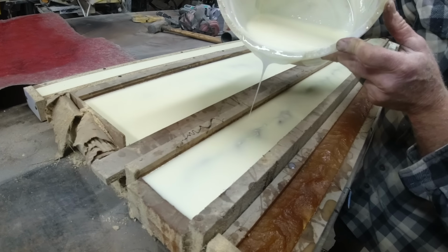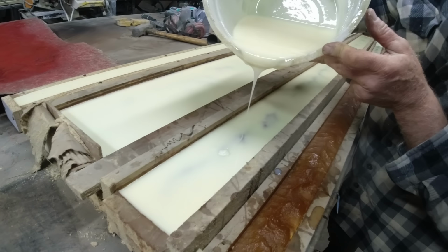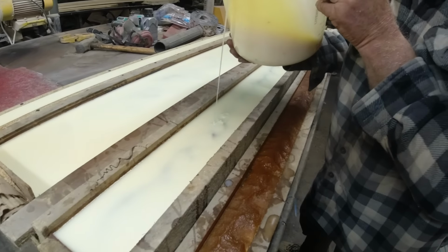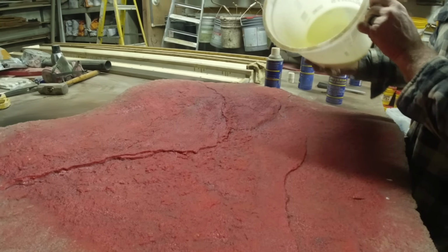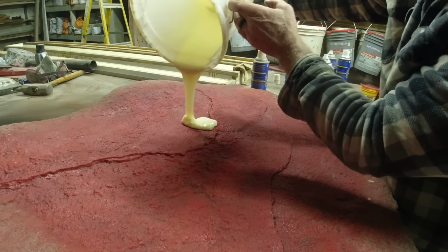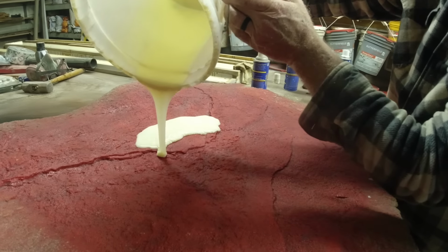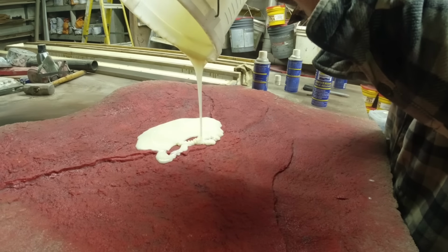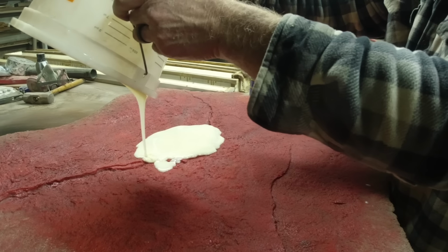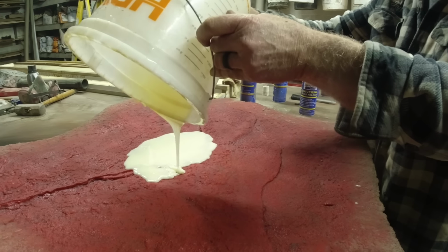You can always add it, but like I said earlier, when it's overflowing onto the floor, that's just money dripping away on the borders. So we'll make another border stamp just with our leftover material. And I'm not going to have much. I might just mix up a little bit more because this is just a little bit too small. Most of our borders are 12 inches.